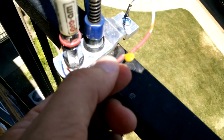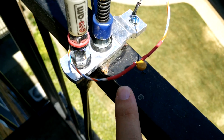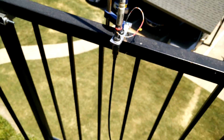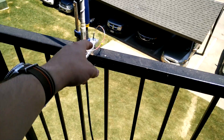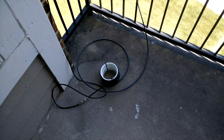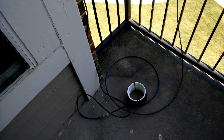This is the 100 pF capacitor that I talked about in a previous article — that helps bring the SWR down on 20 meters a little bit because I think the railing is a little bit long for 20 meters. This gives me a 1:1 SWR with 75-ohm coax, so just keep in mind that 75-ohm coax does work in a 50-ohm system, so you don't have to worry about that too much.